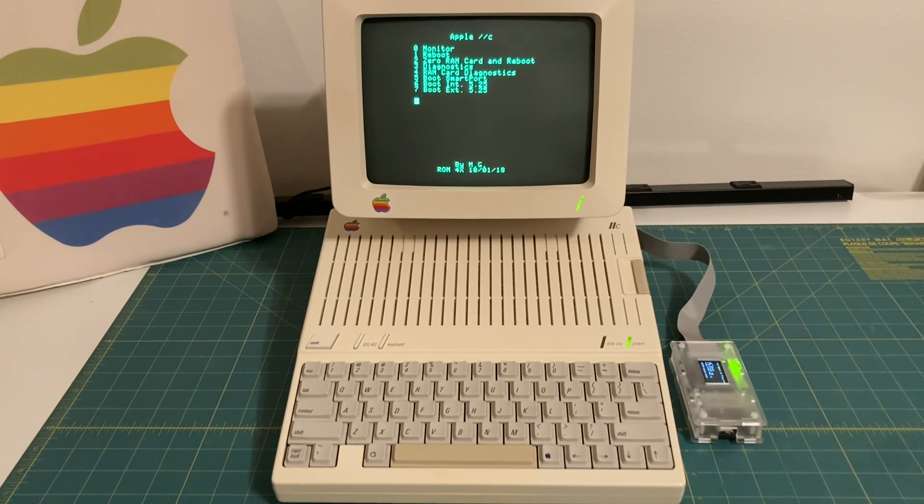The controls are very simple. There are three push buttons on the top that let you cycle through the options. Button A toggles the scan line effect on and off. Button B is the color mode — you can set it to color, monochrome green (which is what a standard monitor would be), monochrome amber, or monochrome white, which is pretty cool. And button C will turn the border off, have a white border, a blue border, or a green border — because some monitors need a special signal to get it to show on screen. Rob goes into the details of that on his GitHub in more detail, so check that link in my description for all the full specs and how it all works.